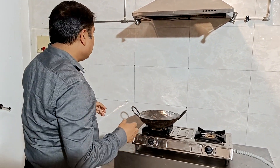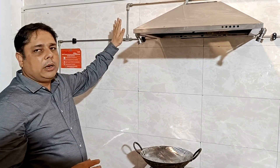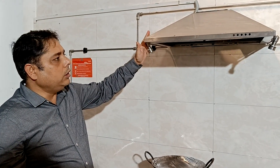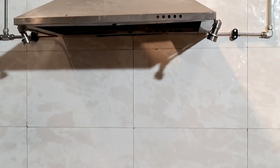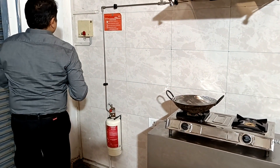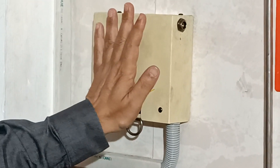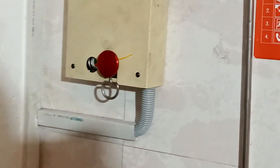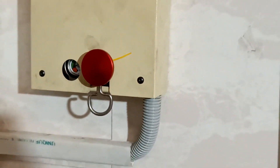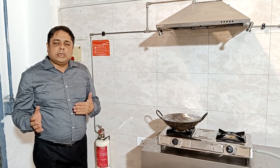Usually in the kitchen environment, if you want to hide the cylinder, its very small compact size allows it to be hidden in the cabinets next to the hood. This was one way that automatic activation takes place. Another way that activation can take place is through the multi release block or the manual actuator. On removing the safety pin and hitting on the red knob, we can simulate the same kind of depressurization as in self-activation. The HST gets depressurized and the system activates.